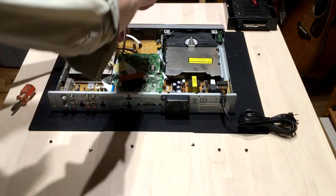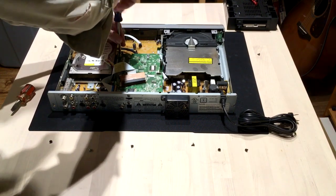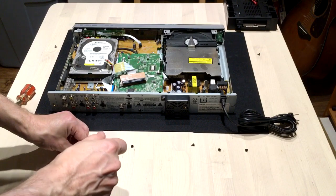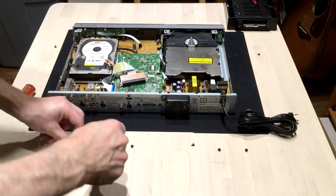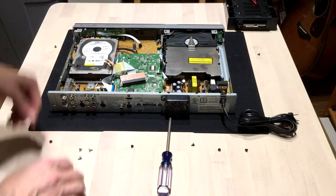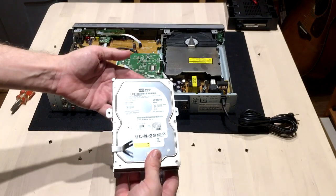It would be kind of nice if I had a motorized screwdriver to remove them, but I'm pretty low tech. So there we go — just three screws. And then just carefully lift the front up, the back out, and then just lift it out like that. And there we go, we've got the hard drive. We're ready to attach it to a PC that's got an IDE connector.